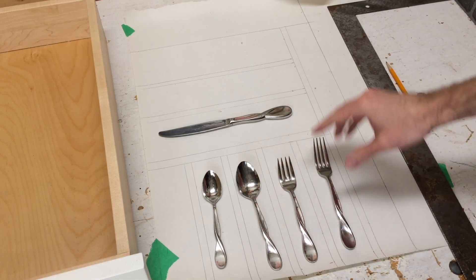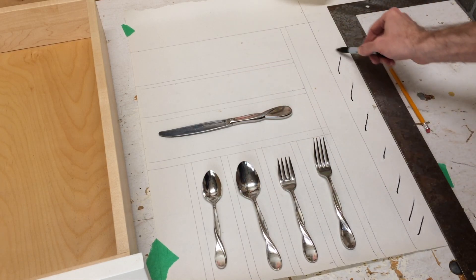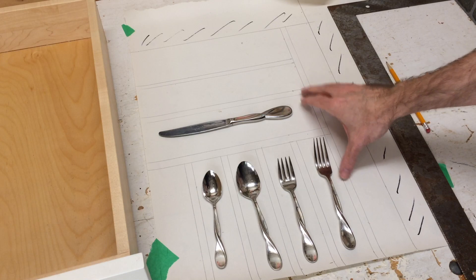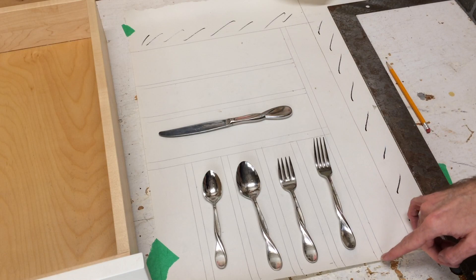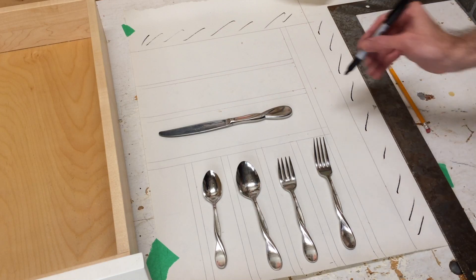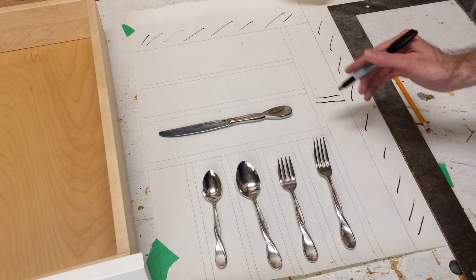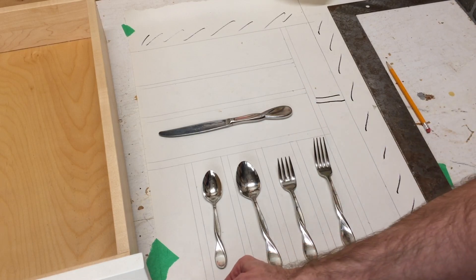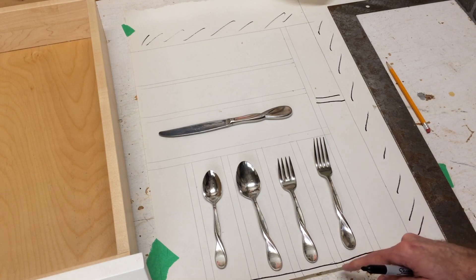I've got these bays where I want them, but I also have to consider how I'm going to put this in the drawer. This is the outside — this is not part of the drawer. What I want to do is put this insert in without nailing it to the drawer, so I want it to fit snugly. I've got a point here to here that'll lock it front to back, but I don't have something side to side, so I think I'll put in a divider somewhere about here to provide that tension. Down here, I need these dividers to anchor into something, so I'll run a board across here that I can attach these into.